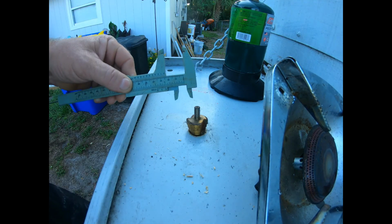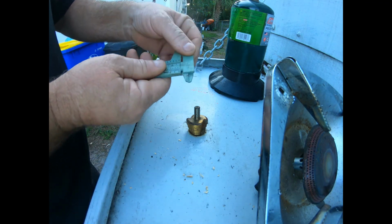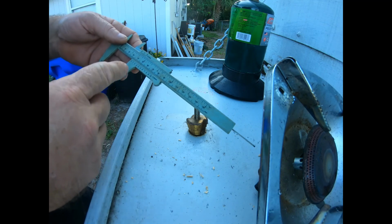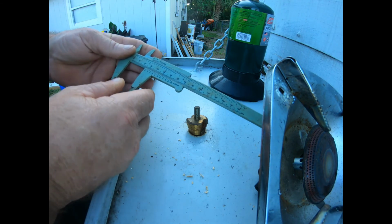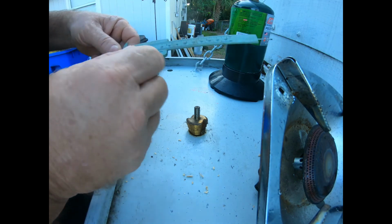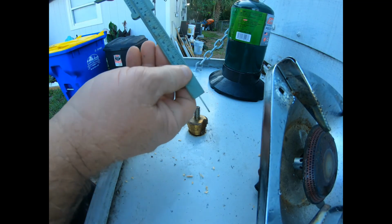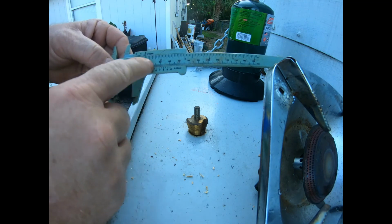So you can pick these up at Harbor Freight. These are great, especially if you're trying to do anything, you know, semi-precise. I mean, these aren't terribly accurate, but these are definitely great for, like, instead of guessing at what size pipes you have, you can easily pop these on here. Now, pipes work on interior, so this checks interior. This checks exterior, and this pin right here checks depth. So if you have a hole and you want to see how deep the hole is, you can also measure it that way, and it tells you on this little dial, metric and inches.